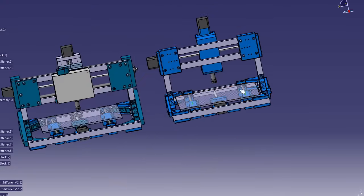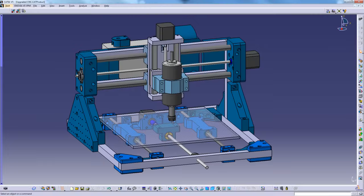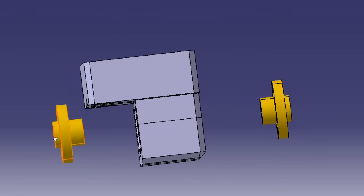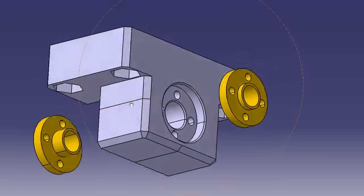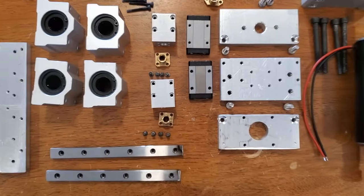Here's a side-by-side comparison in CAD of the original design and the improved one. I've added a new spindle, thicker rails for the x-axis, a whole new metal assembly for the z-axis, thicker 3D printed frame brackets, and one of the most important changes is that every axis now has two nuts on the lead screws that almost entirely eliminate backlash. Here's a view of the new printed parts and all the metal parts that go into the new z-head and x-axis.